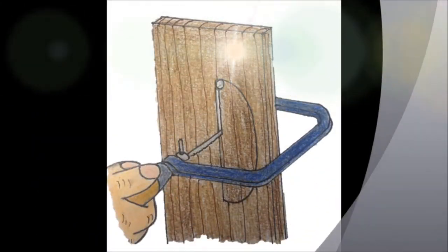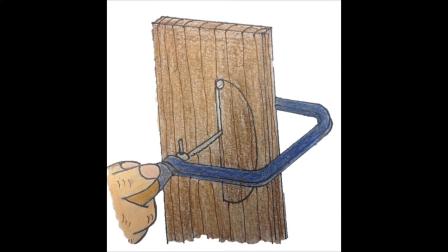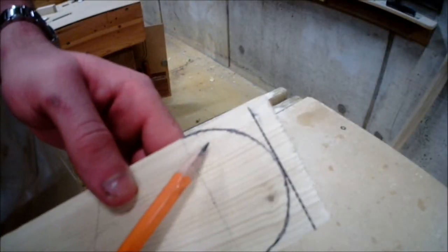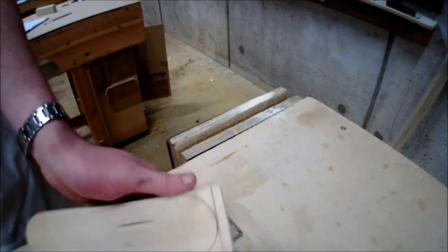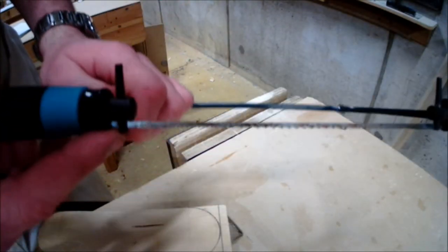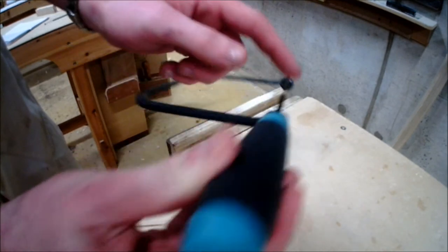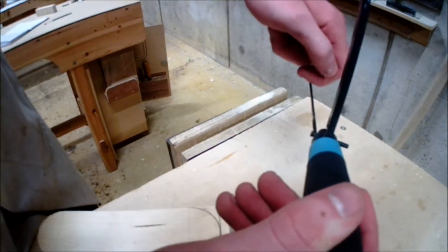As the pins on the coping saw are adjustable, this means you can change the direction of the blade when necessary, as shown in the diagram. Here I'm going to go through the same principles that apply when you turn the blade in a different direction. You can change the direction of the pins if you find it more comfortable, but you have to ensure that the two pins are perfectly in line with each other so that the blade is nice and straight, as previously discussed.